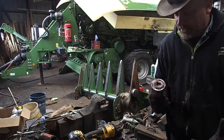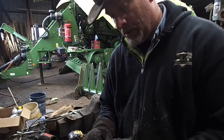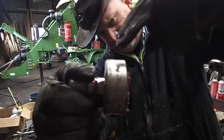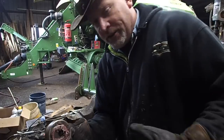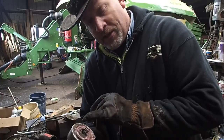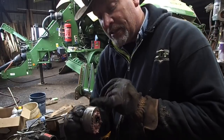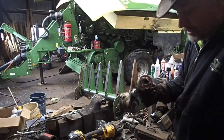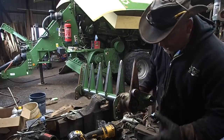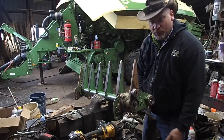As you can see, the amount of grease that's come out of this thing is pretty decent. I'm happy with the way it looks. So the wear on this one, I don't know if you can see what I see with the naked eye, but you can see about two-thirds of this has some major wear on it. It doesn't run on the whole thing. It runs to that outer edge. I honestly think they've made the bearings smaller inside, but made the races bigger to increase the size of that wear point. I was told that's what they were going to do. I don't know if that's what they've done. But if they did, good. If they didn't, well, I guess that's good too, because you just got to know when to change stuff.